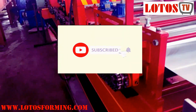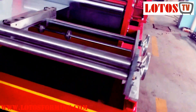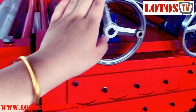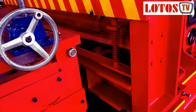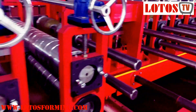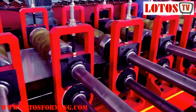The line is driven by chain. Here is the input table, and the first unit is the input table. The secondary part is the feeding roller, and here is the leveling roller — the leveling can be adjusted by this kind of worm gear. Then we come to the cutting die, this is a flat cutting die. Then again we go into the feeding roller and embossing roller, then we go to the punching station for the notch, and the next step is we go into the forming machine.